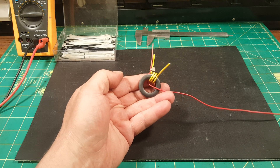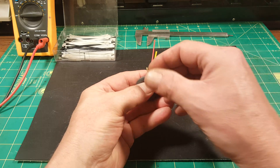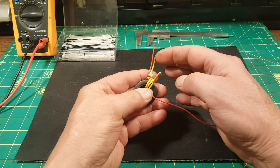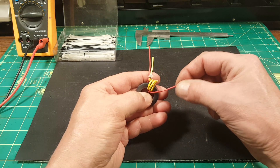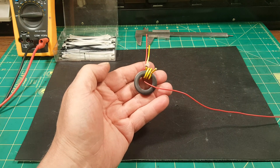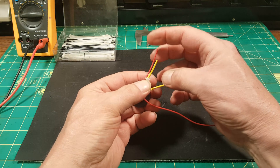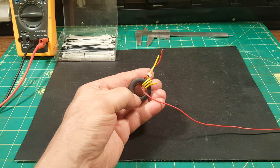Welcome to Little Schmo 2. The three turns of yellow are my primary. I've already placed a red wire — this stuff is 50 thousandths in diameter. The yellow is 77 to 78 thousandths, so this red wire is considerably thinner, and the insulation is also considerably thinner. I'm going to put this through the test to see how it likes watts. At this point I've got the primary wound, the secondary started, and zip-tied to the common ground. I'm going to place six turns on this thing, and that'll be our first tap.